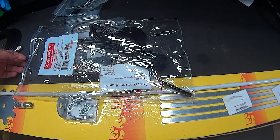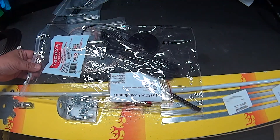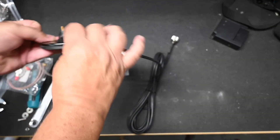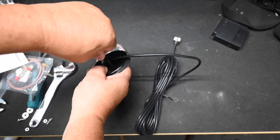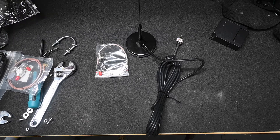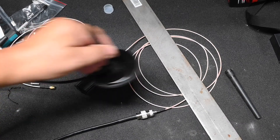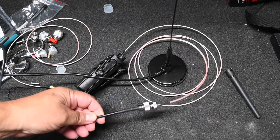For the vehicle antenna, we will be using a general purpose VHF mag mount antenna. While I could cut the antenna length specifically for the MURS frequencies, I think it's going to be close enough. This is called a mag mount and it's designed to fit on top of your vehicle — the steel body makes up the ground plane. You could not set this on top of your RV unless the roof is made of metal, as the magnet must attach and the metal establishes the ground plane. As an alternative, you could get a piece of steel, attach the mag mount to it, and it would probably work.